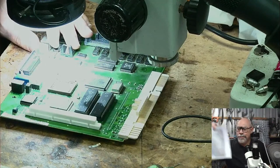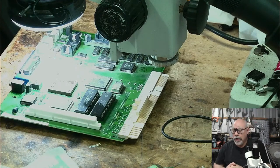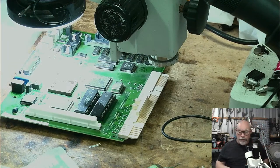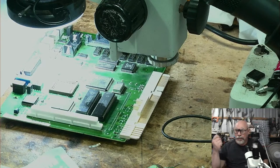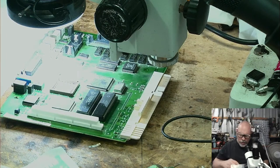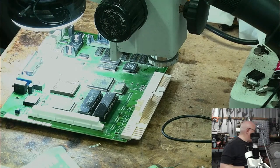All right, so I found myself a cheat sheet for the Color Classic, not the LC575, because we've established this isn't an LC575. I have got three different types of capacitor on here. I'll put the little tiny one on first. I had to order some capacitors last night, like $150 worth, so I was running low on a few. Those who saw my analog board recap of the Color Classic recently, I kind of ran out; just about every cap I was pulling out of the container, I was like, oh, that's my last one. So I had to do a big order last night, and I've got a whole bunch of new caps coming next week sometime. So, 1 microfarad, no, none of those. 10 microfarad, 16 volt. There we go. That's what we're going to use.